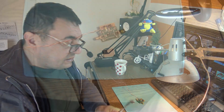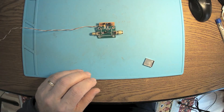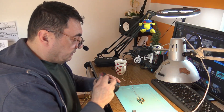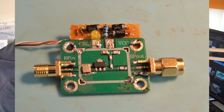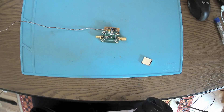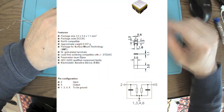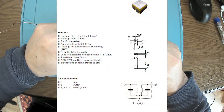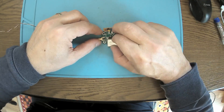Let's take a look inside. You can see here very well — that's the filter at the input. As a rule, you should have a really good connection to the ground for all the pins of the SAW filter. It has 6 pins — you'll see it in the photo — and those pins really need to be grounded very well.